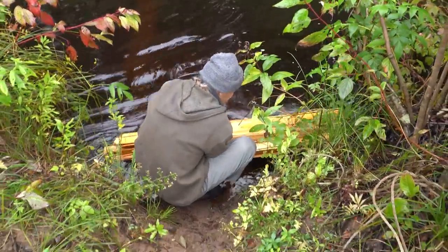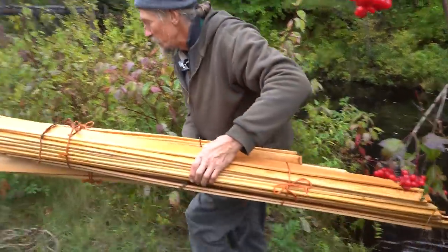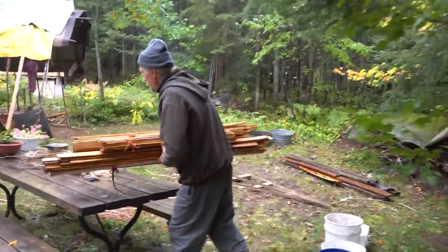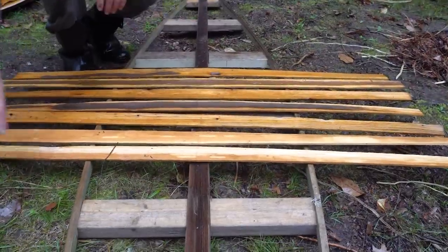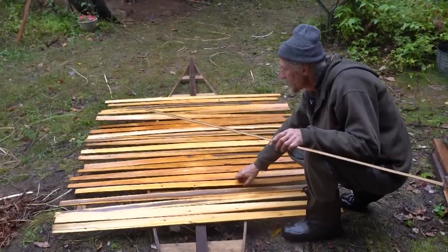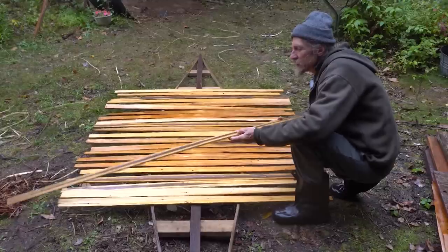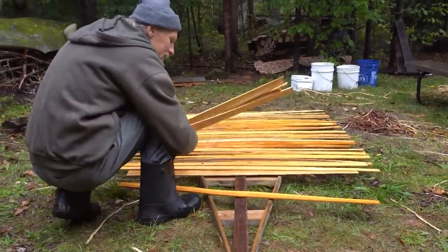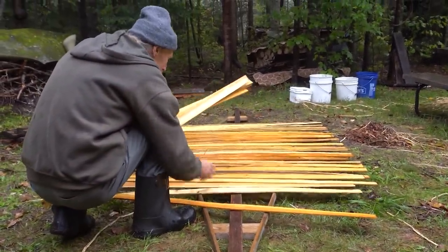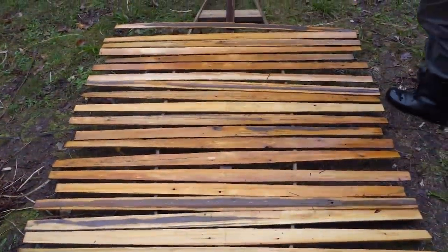Bring the ribs in — they've been out here for a few days. Let's see, 53, 54 ribs. I always make a few spares of each size. We need to find the 50 best ribs out of this pile. Each rib has a perfect spot where it'll be best suited, like where a knot is — maybe you don't want the bend to be there, or it's a little skinnier so we'll put it towards the end. I like the wide, fat ones in the middle. It's kind of like building a log house — every log in the pile has a perfect place, it's up to you to figure out which one. Now we've got to find the perfect rib to do the end here — that's a pretty tight bend.